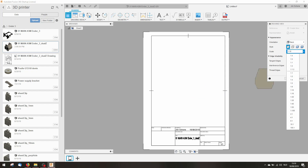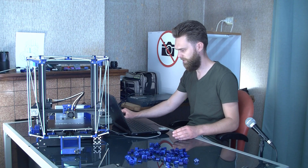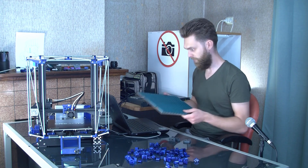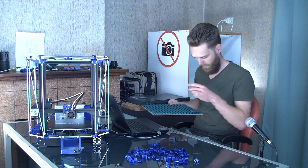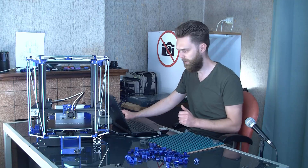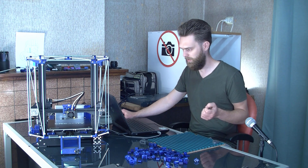This is the top view — the scale must of course be one to one. I'll hide all bodies except for number 17. This is the part I want to cut out, so I'll create a PDF. I'm going to open Inkscape, press Ctrl+Shift+G to ungroup everything, and remove the template. I'll use the build plate I made for laser engraving these parts. The G-code created with this tool doesn't have a homing sequence, so I can manually add the laser engraving to the correct point. I have more information about this tool in my second video, where I use it to cut out a butterfly with the J-Tech Photonics laser tool in Inkscape. I'm going to upload this to the CR10, run the code, and see what happens.